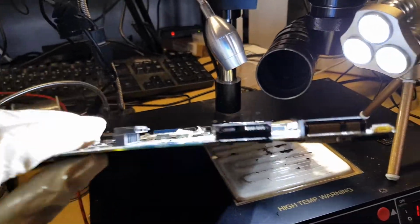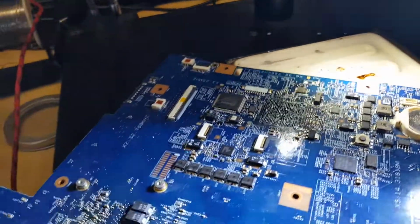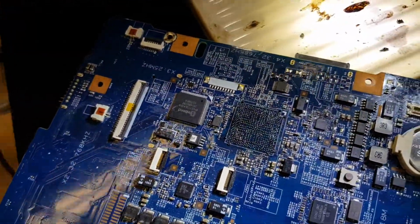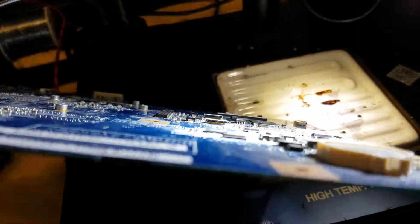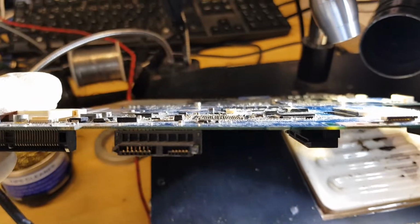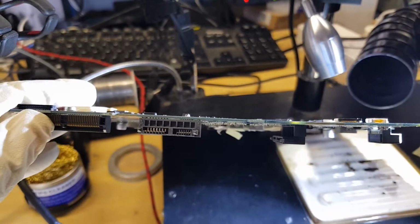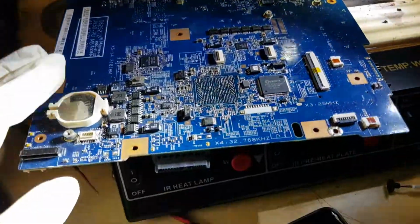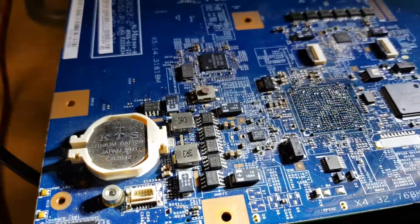So this is bad. It's a bad way to remove a chip. The preheater is a must, and coming at lower temperatures to remove the chip. We'll give it another go shortly, but that's the issue. Alright, and we heard some popping sounds here and there. Yeah, not good. Alright, see you in the next one.